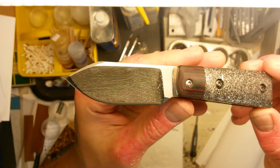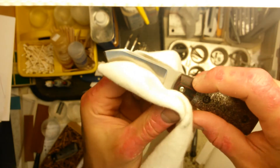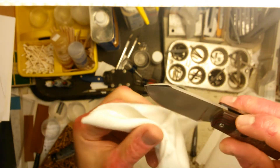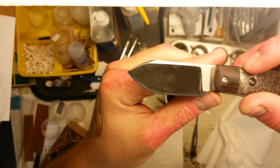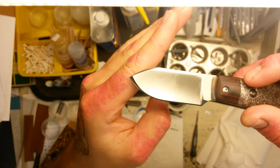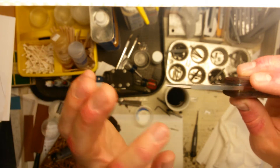You can see there's oil on the blade, which I always put on because these are not stainless. And even if they are, I usually do it anyway, because even stainless can rust and it's just good to have some oil on the blade. It's hollow ground, 320 satin with a satin finish on the flats as well. It's got a little swedge on there just to add a little bit of accent to that tip, a little bit of complexity. Still got a nice thick tip.